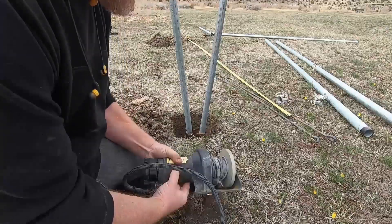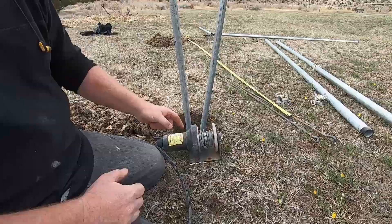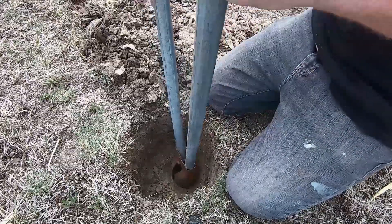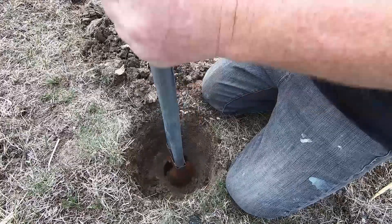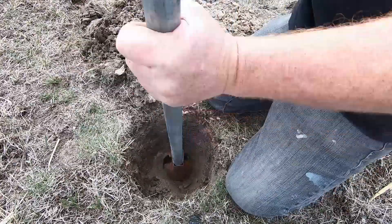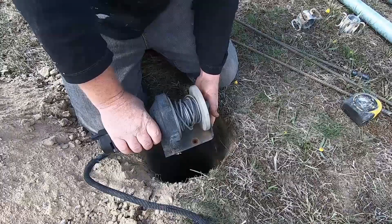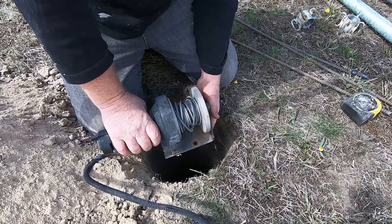The layout itself is pretty straightforward. Just make sure your holes are symmetrical. You've got four guy wires and you've got your center post, or pier, where the tower rests upon — which is not going to really experience a whole lot of forces, the center part that is. The dead men, yes, they will experience forces. They're going to try and pull up out of the ground.